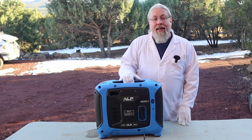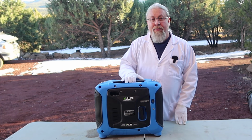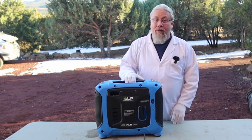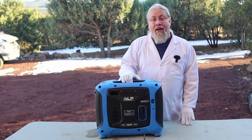Well, it is kind of loud. Now, they say in the brochure like 54 decibels or something. I didn't see that in my testing. I saw mid-70s decibels on the lowest setting with no load. So it's certainly louder than a Honda or a Yamaha, but then again, this is half the price.